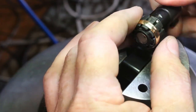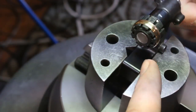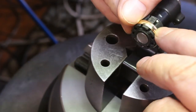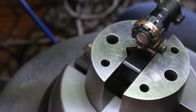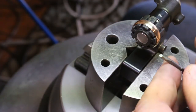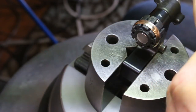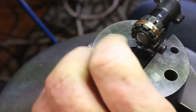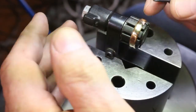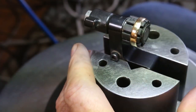So to recap, what we've done so far is to confirm that the design that we want will fit the ring, laid out in the segments, the number of segments that we've got laid out. And we've marked each segment, and we've marked the border. Now what we'll do is engrave the border. I'm going to be using a 90-degree, single-point engraver. This is a Lindsay grind from Steve Lindsay. I like his tools. I like his way of thinking about tools and engraving. He's an amazing engraver.